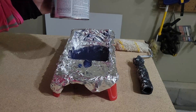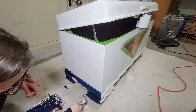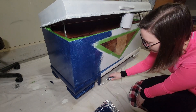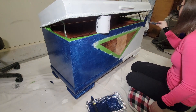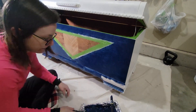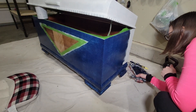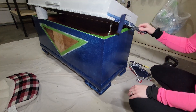This new-to-me paint is Sherwin-Williams Emerald Urethane Trim Enamel in the color Anchors Away. I was really disappointed with the coverage — it took me four to five coats to get full coverage. The durability seems really good; I did a scratch test after my second coat and nothing came off. Leveling is great too — no brush strokes or roller marks. I'm just really disappointed in the coverage. There were reviews online where a lot of people had the same issue, so I might try it again in a lighter color but I definitely would not buy this color again.